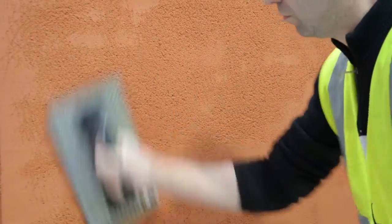For scraped finishes, apply a few extra millimetres. Then, while the render is still green, use a scraping tool in a circular motion on the surface, moving in circles and making sure no part is missed. Once the scraping is done, go over with a soft bristle brush to remove loose material from the surface. As lime renders don't cure as fast as cement-based ones, gently spray the surface with water to stop it drying out, and in warm weather cover with damp hessian.